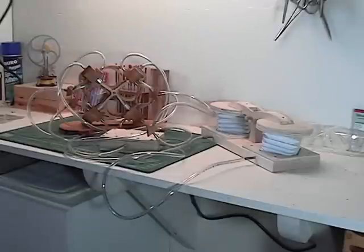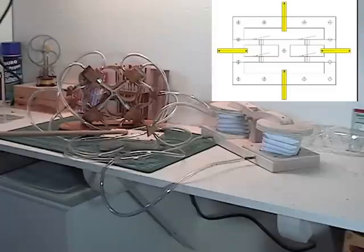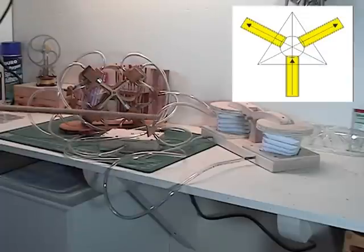I've received some requests to explain how the engine works. The bellows produce alternating air pressure as you go up and down, which goes to this box. On opposing sides, through a series of reed valves — basically paper flaps — it produces a continuous flow of pressure and vacuum out of the air rectifier.